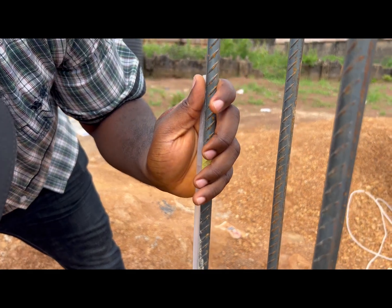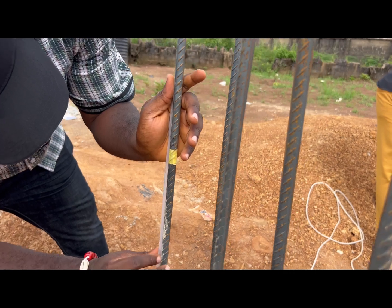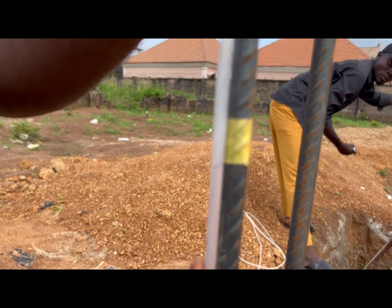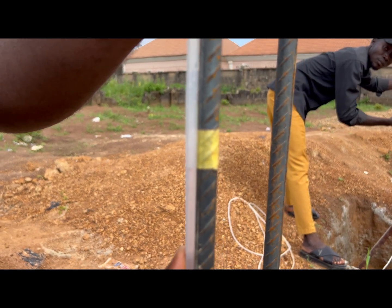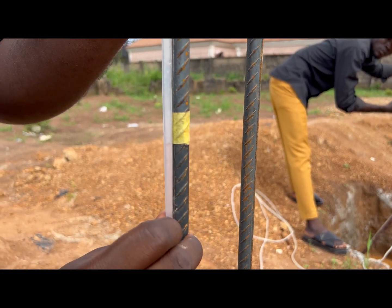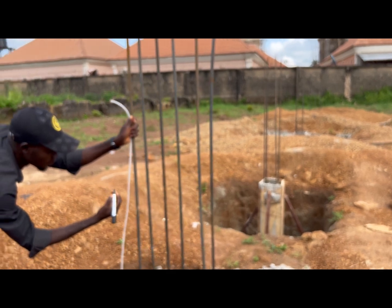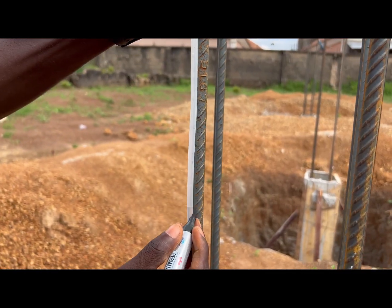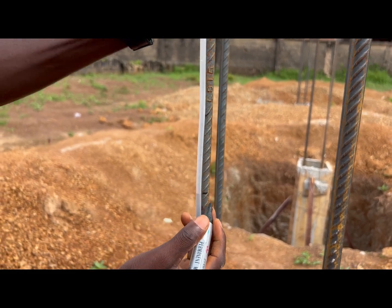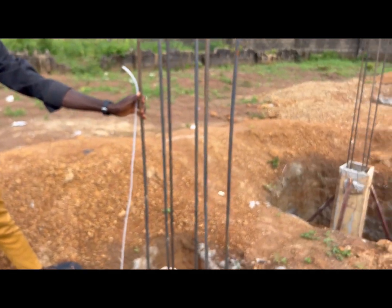From here we've marked our level — the top of this masking tape is our level. They're going to adjust to get exactly that level. They're adjusting it. At this point the meniscus has coincided with the tip — so it says mark. At this end they draw a straight line. You can see the meniscus — they mark it. This level and that level are now equal.